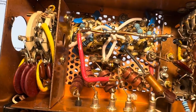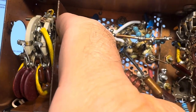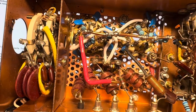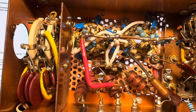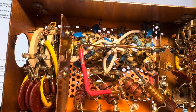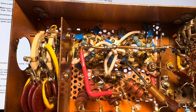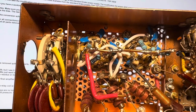I put a bunch of these little .005 capacitors on here and just grounded them right up to the case and soldered them on the top. There's really no rim on the socket to solder to, so I just put them up to the case — I guess that's an effective ground. I still need to attach the bias voltage and the screen resistors or screen voltage. I think the rest of this thing is done, so just a few more pins and I think I'm done.